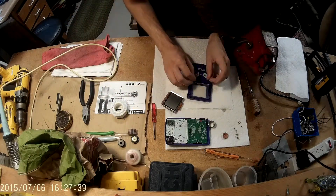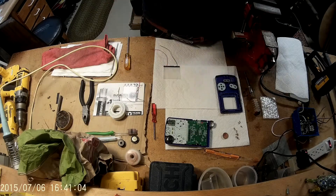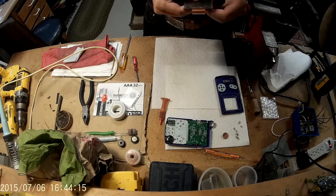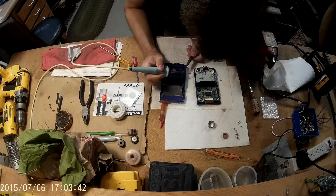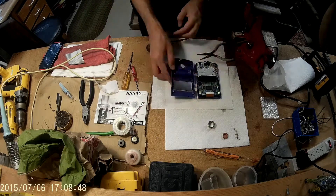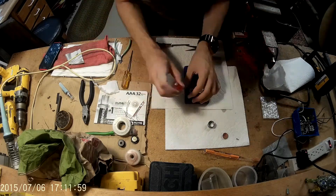Now I've got my new replacement front light screen and I'm going to try it again. I take the old one out, clean the screen off as best I can to get any dust or specks off. I wipe down the front screen and this time I correctly add the proper amount of loca glue - no gelatinous glue this time. I had the display hanging off the side so the ribbon cable was not pressing on the flat surface, as laying on the cable leans it up and can slide the screen down.